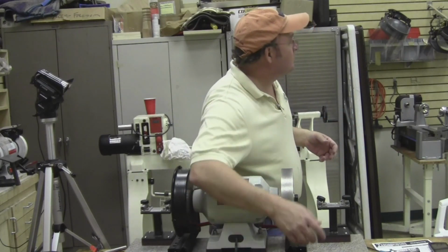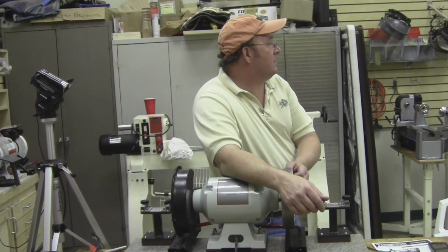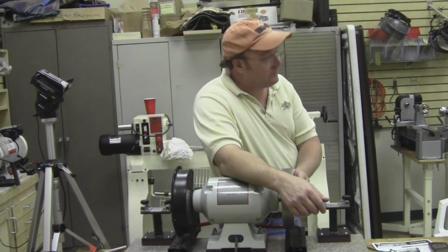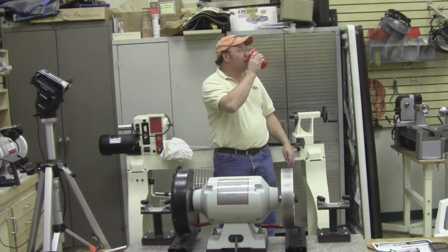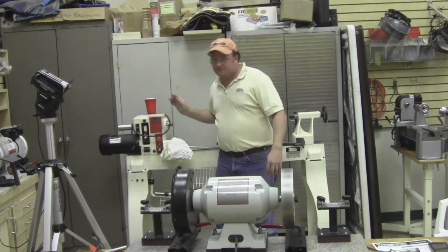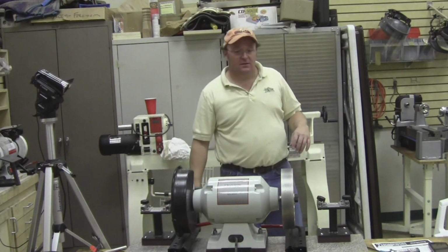Alan, let me interrupt you. Yes, sir. One thing to be real careful about, make sure if you get a wheel like that, it's CBN. Yes. It's cubic boron nitride; you'll see those same kinds of wheels with diamonds on them. Yeah. Do not get diamond wheels. Right. The reason for that is that the temperature that's created when you're cutting steel actually dissolves the diamonds. They will literally dissolve off the wheel, so don't get a diamond wheel. Yeah, they load up. Now, like I said, diamond's fine for carbide. They disappear. They literally are dissolved by the steel. It's carbon and carbon, and it just goes right over.